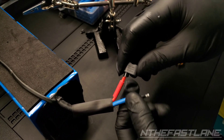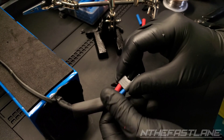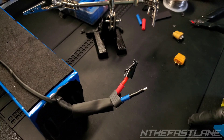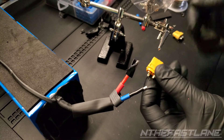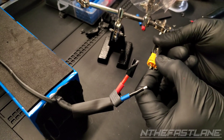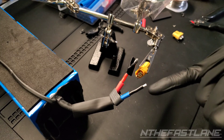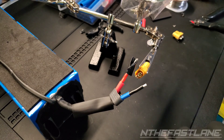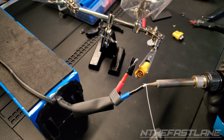Just go ahead and twist that tape, put this like this, and slide that to the back. Now take our XT60 female and put it on the little clip. Make sure your negative is where it needs to be on the clip — it has a little negative symbol. Get this set up and put a little bit of solder on it.